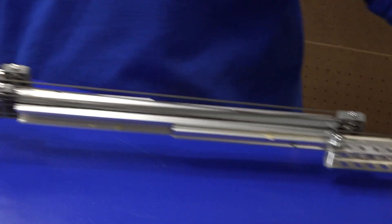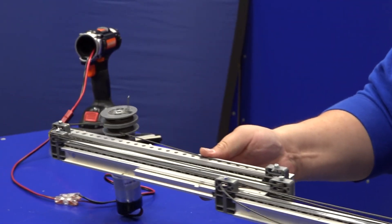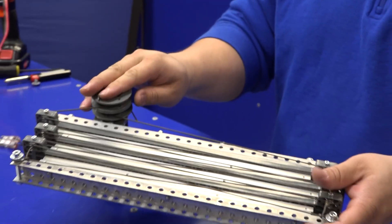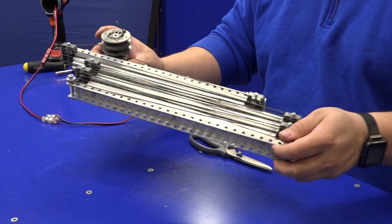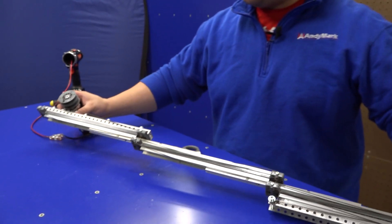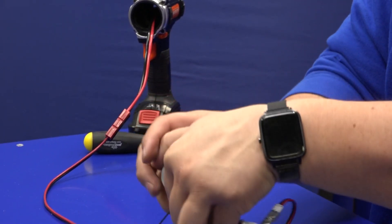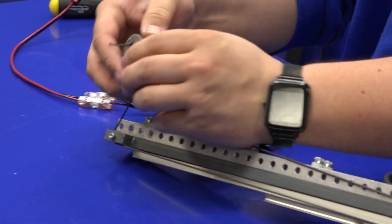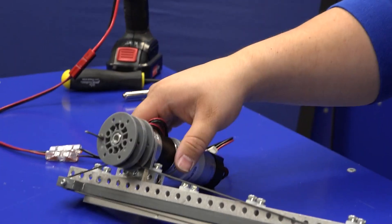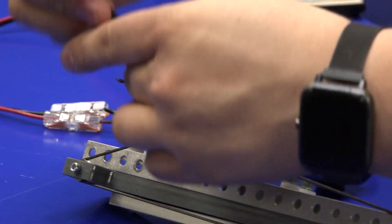Make sure all the slides can move. Before putting the retaining screw on, go halfway extended — that's where the string will be loosest. At that point, take the down pulley off and twist it until the string is tensioned, then put it back on the shaft. Once fully tensioned, put the retaining screw back into the end of the motor shaft.